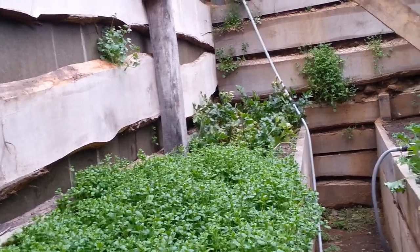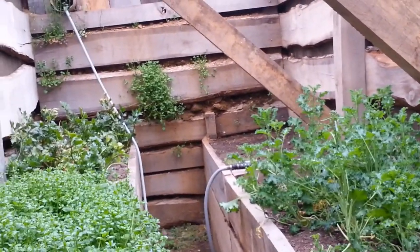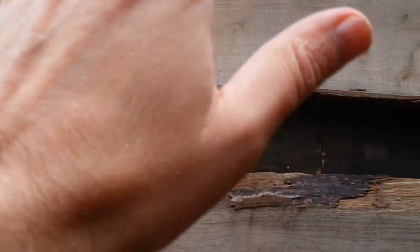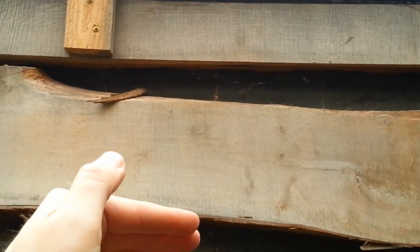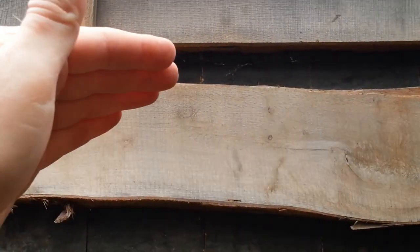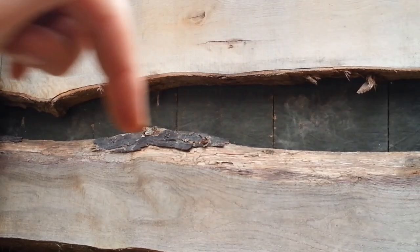But first, before you dig the hole, this is what I told him to do here — and both of them didn't do that. What I'm saying is that you want to dig the perimeter umbrella effect first, before you dig out this area. Think about it: this is all earth right here and you haven't dug this out yet. You want to be going from the ground level and then going down, say four feet out, two feet deep — on a decline. You do that around the whole perimeter that you want to work with.